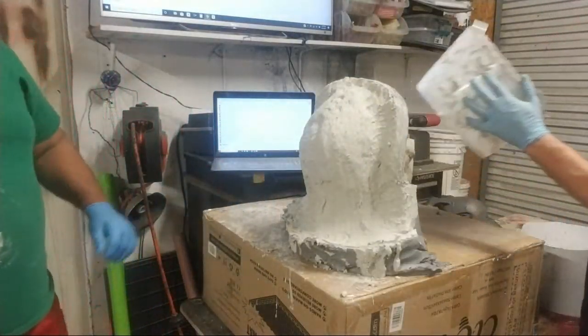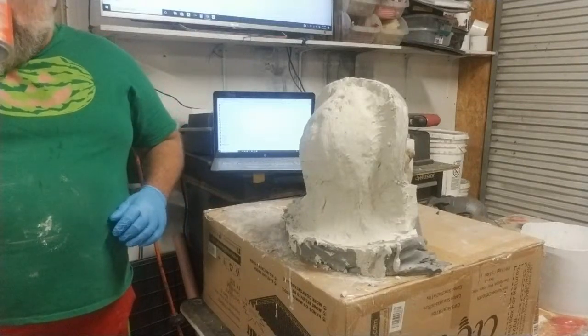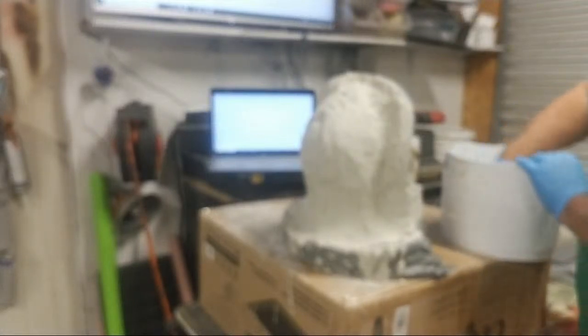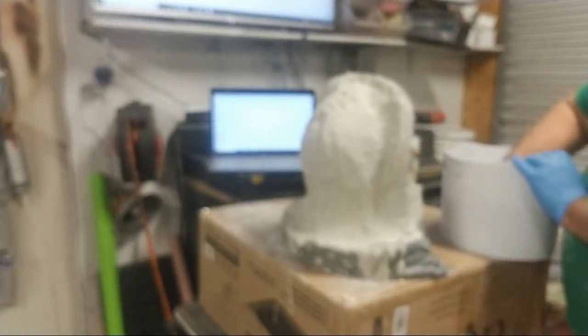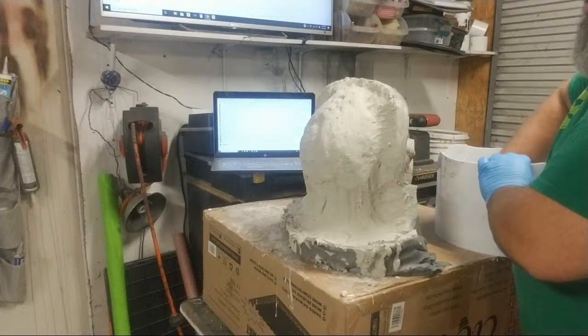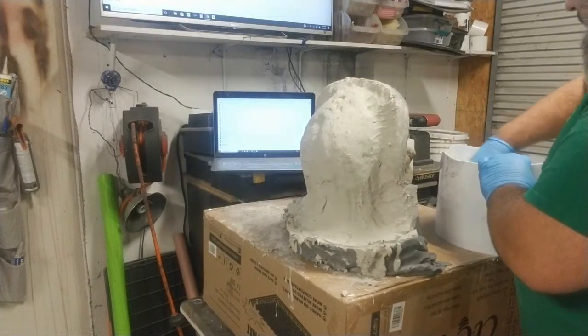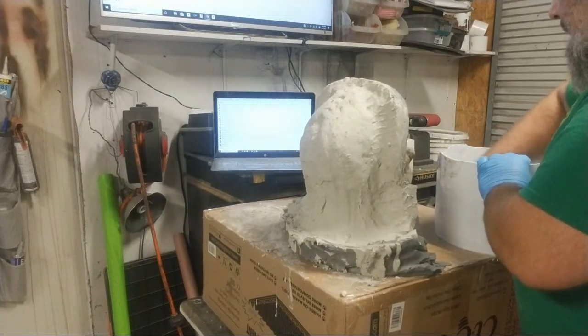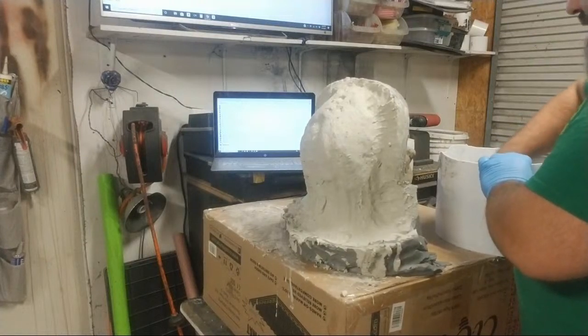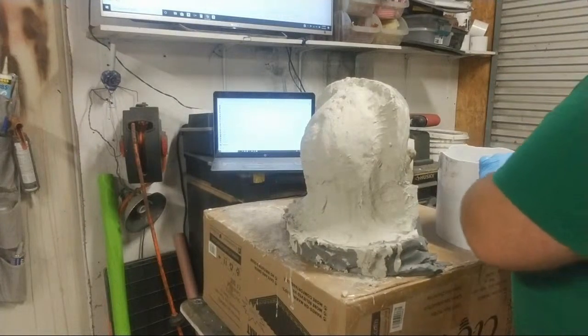Ed Edmonds prefers U.S. Gypsum because it skins faster. When you dwell the mask, meaning when you pour latex into the mold, however long it's in there determines how thick that skin gets. U.S. Number One Pottery Plaster is the fastest skinning. So if you are running commercial mask making, then you might want that. Remember, Ed Edmonds doesn't make one mask at a time. He wants 50, since he's selling to Morris Costumes. Most of us have a much smaller production. UltraCal is probably the strongest of them.